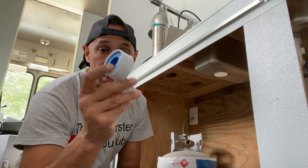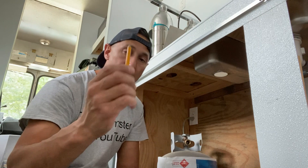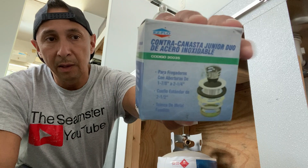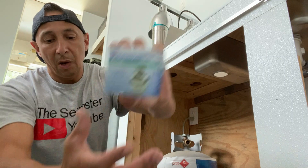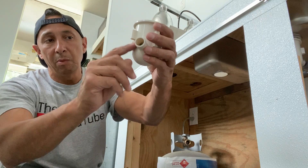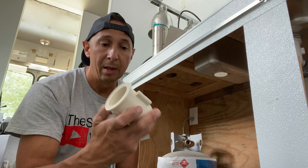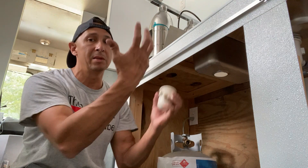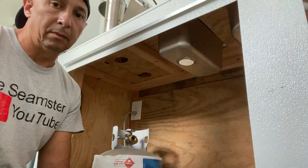You're also going to need some elbows, plumber's tape — that's very important, the blue not the yellow — wide-mouth channel locks, utility knife, and something to mark with like a pencil. The air gap drains are your brains right here. Remember: what drops down goes into a bowl, feeds out, and almost works as a p-trap. Inspectors are going to look for that air gap on your vehicle, your food truck or food trailer, because it stops contamination of water from one drain going back up into your wash, rinse, or sanitizer basin.